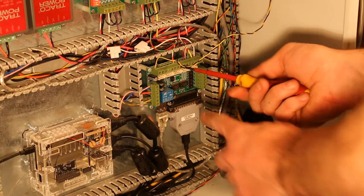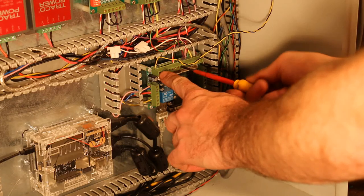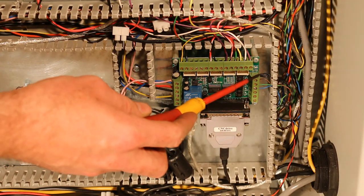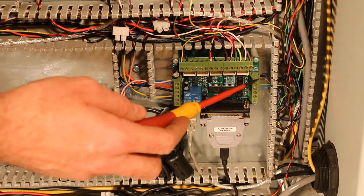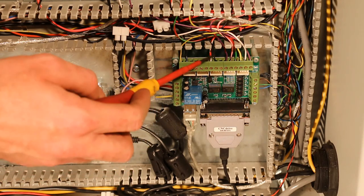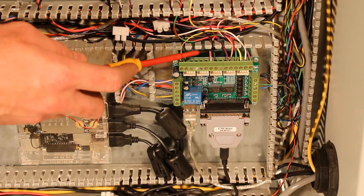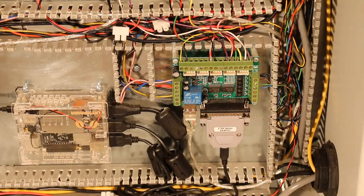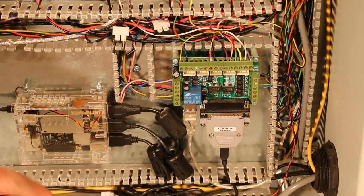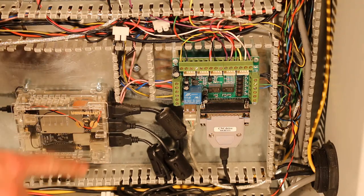As you can see here, the numbered terminals are the negative and the common is positive. So these are the three input signals wired in, with the three black wires coming into one terminal, which is how this breakout board works. The yellow anti-dive wire goes into a permanent live, and then there's a switched negative on the signal number pin for the return. This is the UC100 CNC motion controller, and this is a LattePanda — the whole computer that runs my CNC machine. If you also want to know how to set up and use this product, please look at my other videos by clicking on these links. I'm Albert Price — I hope you found this video useful, and thank you for watching.